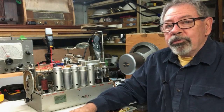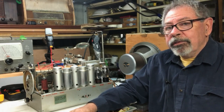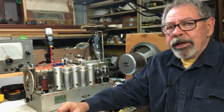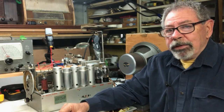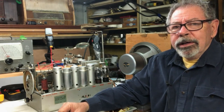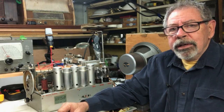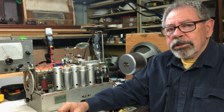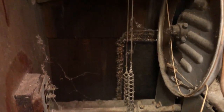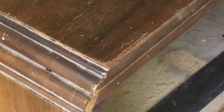Good day and welcome back to the shed. This is part 3 of the AWA Radiola Fisk from 1941. We've got the chassis working very nicely now - it picks up on all the shortwave bands and AM. I put the speaker in the baffle behind me for safekeeping. I had planned to get started on the cabinet this week but it's not good weather for cabinet work - it's raining and apparently going to rain for another three days. So I thought I'd get started on the dial mechanism, which is screwed into the top of the cabinet and needs a bit of work. There's a chain drive that runs a drum arrangement in it, and the dial itself needs cleaning up.